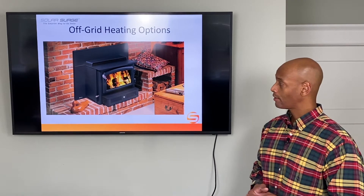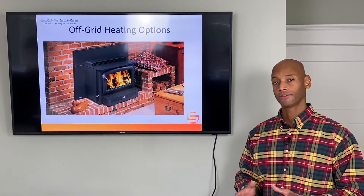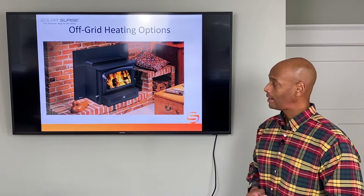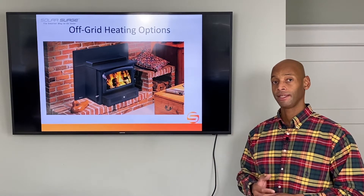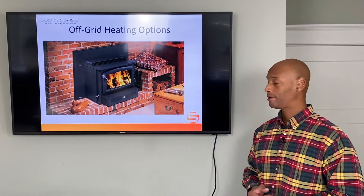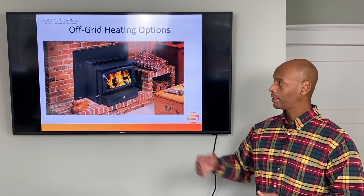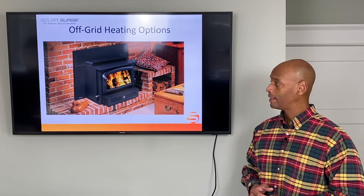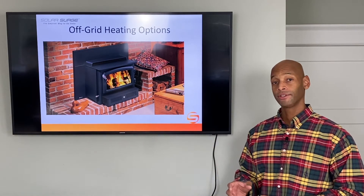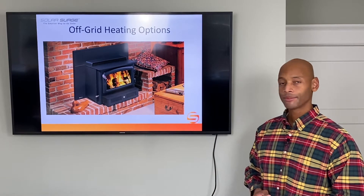This is a great option if you're looking to heat the home in a grid-down mode without using a lot of electricity from your batteries. The pros are that your fuel source is wood — a very renewable fuel source. As long as you don't have a problem chopping, splitting, and storing the wood in a dry place, in theory you could heat the home indefinitely, as long as you have good timber on your property. The downside is that the home must have a wood fireplace with a chimney — it cannot be vented out of an exterior wall in most cases and does need a full wood fire chimney. It also creates a lot of ashes, so every day or so you'll have to clean out the combustion chamber. Another advantage is that it allows you to control the rate of combustion to conserve your fuel, making it more efficient than a traditional wood fireplace.